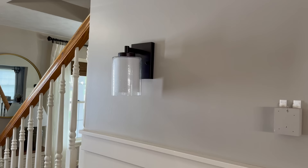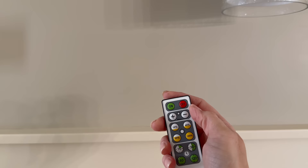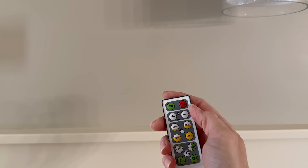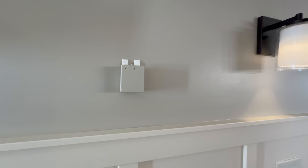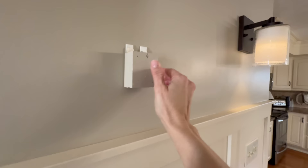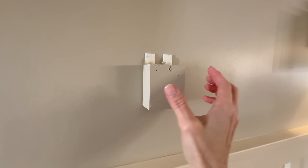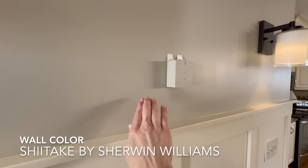Along our staircase wall in front of our board and batten we have a console table that I'm excited to completely restyle for spring. Above it we have additional lighting with two sconces — since we didn't have electricity on this wall, we hung them and installed puck lights on a remote. I'll also explain our DIY block hanger: because of the wooden lip on the board and batten, my husband's genius solution was to cut a block the same depth as the overhang so artwork hangs plumb. I secured it with velcro command strips, added a screw at the top for a picture wire, and painted it the wall color so it disappears.